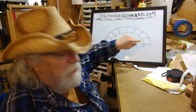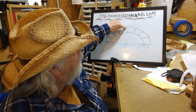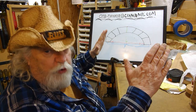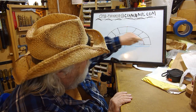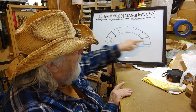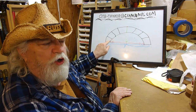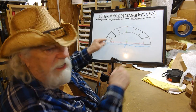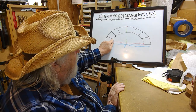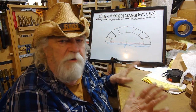That's why you want to have a few shims ready to use, because you're going to put those shims in there to shim it up to the exact amount. What you do is put your bar clamp on there and tighten it down. If you're opening up your joints on the outside edge, the cleats are too close together — just put a shim on the outside and push it out. When you tighten it down and it doesn't close on the inside but is tight on the outside, you need to take shims out instead. Once you've got it set and the clamp fits tight on both sides, you're good to go. Just put weight down to hold it flat on the table and you're done — all you need is the bar clamp.